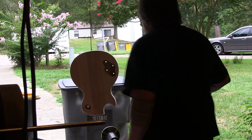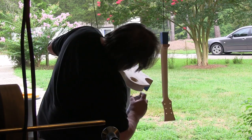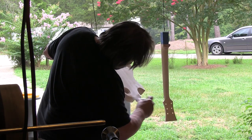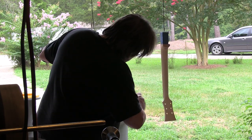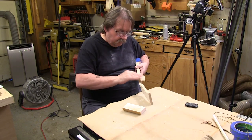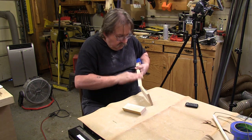I decided to tough it out with this guitar and use nitrocellulose lacquer, which is pretty hard to put on and get right. And that meant starting with a few coats of sanding sealer to start getting the wood smoothed out. I used just clear lacquer on the neck, a whole bunch of coats of it, with a lot of sanding and tack ragging between each of the coats.